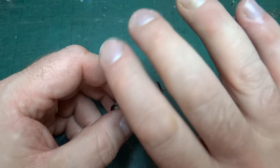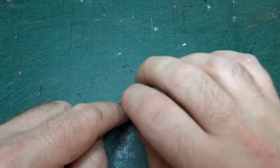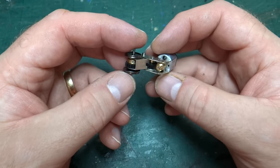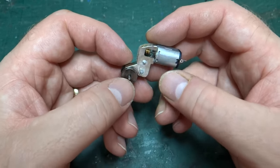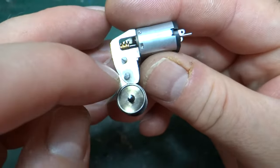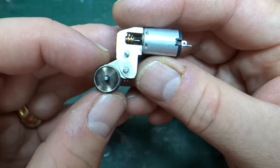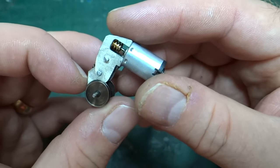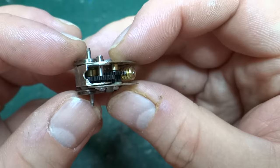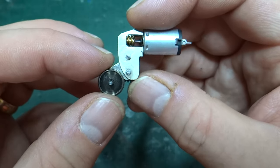I basically need to get the motor quite low down and quite far forward so that the wheels can be almost under the cab, but the motor further forward into the boiler. So I've done all those adjustments - I actually had to do slightly more adjustments than I expected once I started looking at how it would fit into the body in more detail. You can see I have cut away quite aggressively at the bottom corner here of the gearbox sides. That allows this bottom piece to swing without the 9mm gauge wheels catching the gearbox. It's a very tight fit and the chances are they're likely to short, so in reality it's going to be folded all the way around here and we're not going to get any shorts.